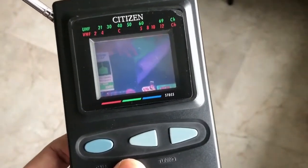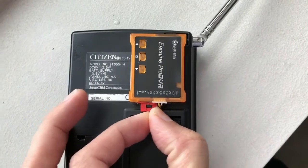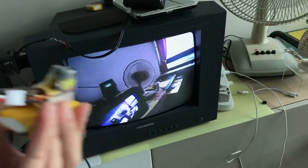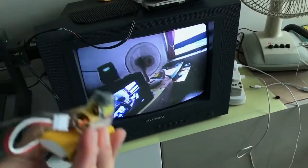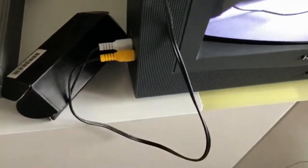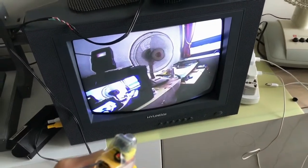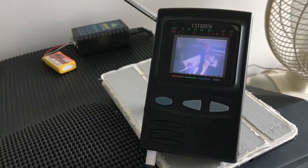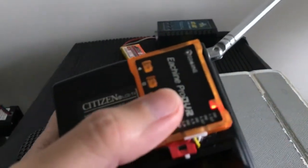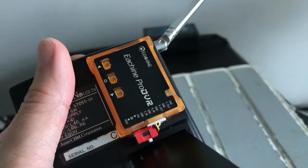The pocket TV build is complete. This is the AV out and this is the DVR. Let me power on the DVR now. Here it is in action — let me move the video transmitter. The AV out signal comes from here to the TV. I could plug in my FPV goggles and fly FPV in UHF now using this pocket TV, and I could hit record at the back to record the flight footage. It's recording now. That's all I have — I hope you enjoyed this video, thank you for watching.